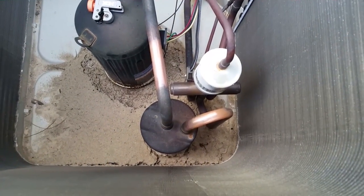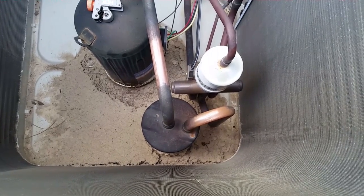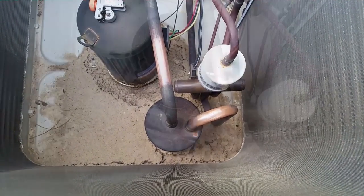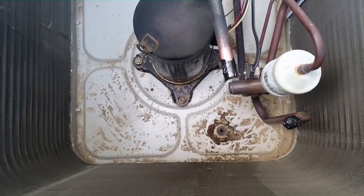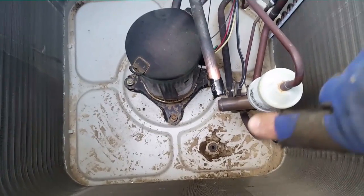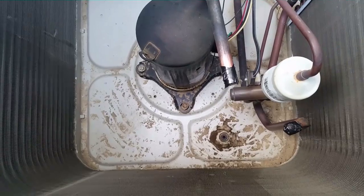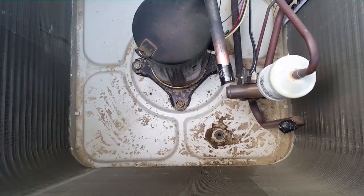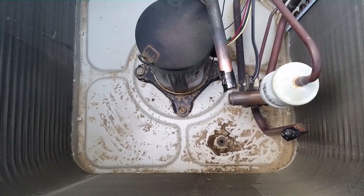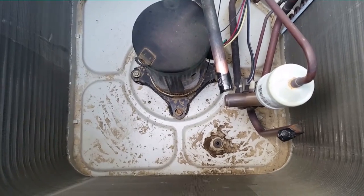My two pipes going to the accumulator are cleaned off. I'm going to cut it out, unscrew it, and we'll either fabricate new pipes or sweat the old ones out of the accumulator. Most of the debris is cleared out with the shop vac. Right here where the accumulator threads on, I was always looking for confirmation I found the right leak — and right underneath there you can see a darkened spot where the dirt had oil in it. So I'm pretty satisfied with that. I'm going to put the new accumulator in and start fitting up the pipes to it.